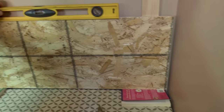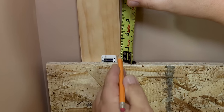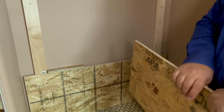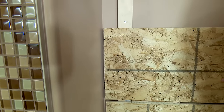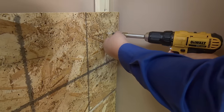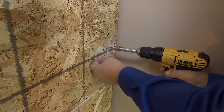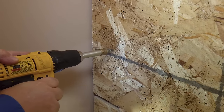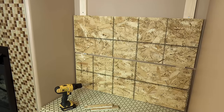We need to be sure that our panel is not going to move, so we are going to secure it with a single screw on each side at the center location of our panel, drilling into the mounting board underneath. Once that first panel is secure, we can follow the same procedure for the second panel above it. Here we are going to measure up a half inch, but it is easier to use spacers — since our OSB is a half inch, it works perfectly as a spacer to indicate where that second board should be mounted above the first. Once it is centered, we will drive a screw in the center. We will follow this same procedure for every panel all the way up the accent wall, then drill the holes for the bow clips and remove those screws.